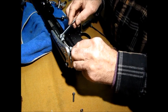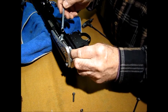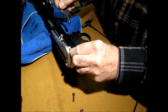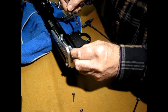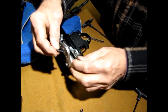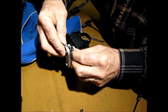And once you get it all dialed in to where you want it, and the length, everything, then you can go back, see how that's just moving a little bit. That's okay. Take the play out of it. Okay, so there's a couple thousandths there. Now you take this little dude and you stick it onto the bearing.